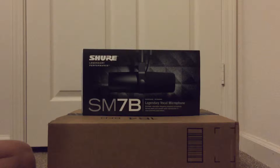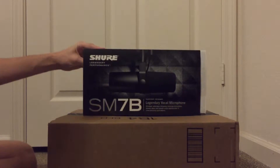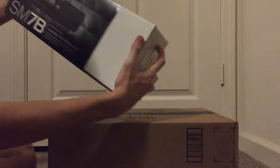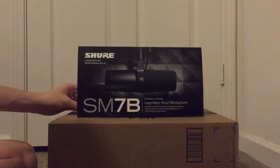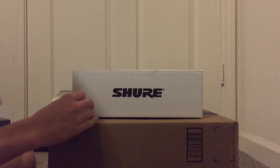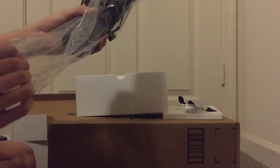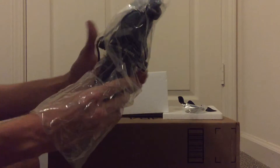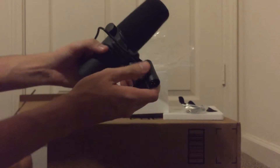And now for the reason I made this video, and more than likely the reason you clicked on it in the first place: the Shure SM7B dynamic microphone. This microphone is a moving coil cardioid dynamic microphone with a frequency response from 50Hz to 20kHz, and requires at least 60 decibels of gain, so make sure your preamp and/or interface is compatible. There's a hum pickup rejection of around 11 decibels at 60Hz, and this thing weighs about a pound and a half — meaning this is probably the heaviest dynamic microphone you've ever used.